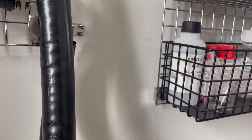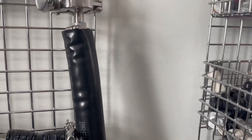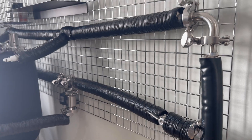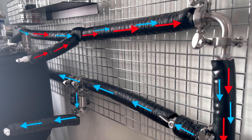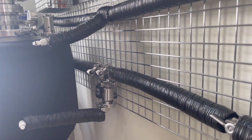The pump is going to feed glycol into the bottom line — the line with the solenoids — to release the glycol into the jackets. The idea is for the chiller to also chill the lines, going all the way down, up, and back down and around, pulling any warm glycol released from the fermenter with it.